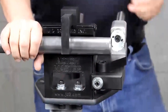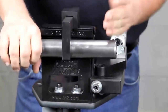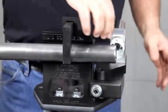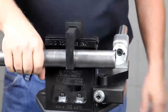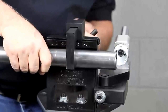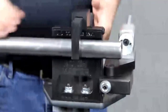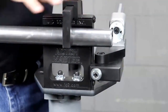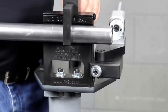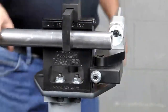What we're going to want to do is put the tube in maybe about a third of the way. You don't actually want to put the tubing into the center of the saw. If you move it out a little bit, you'll see you leave yourself enough room for a nice chamfer on the weld — you don't have to chamfer it later, it makes it very easy. So about right there is pretty good. We're going to tighten down this clamp. This block up here is really just there to keep the clamp from falling on the floor — there's nothing structural that it's doing.